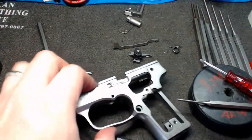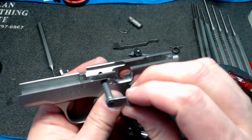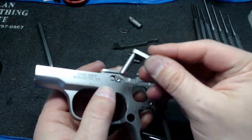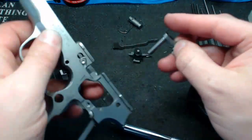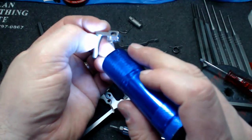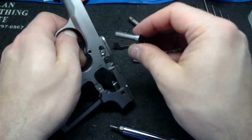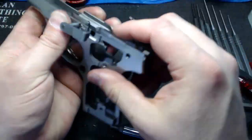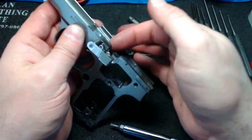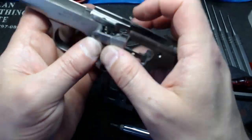And that's just the spring that serves two purposes in its life. One is it's the retention for the main pin. As this pin goes in, you're compressing this spring a little bit. And if you can tell, there's a notch at the back of that pin, and that's what that spring pops into. That makes sure this doesn't drift out. So it just provides a little extra tension. As a general rule, the back bump on it here is enough. It's going to be on the inside of the slide, so it's not generally in a position to move. That's just one extra tensioning mechanism.